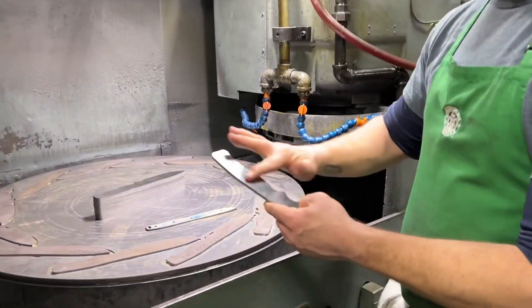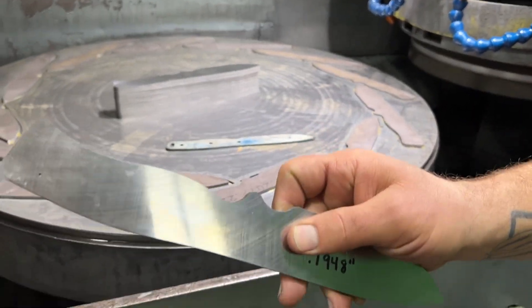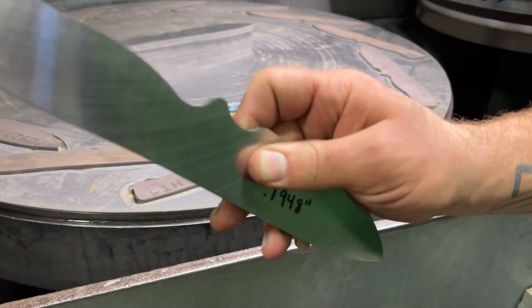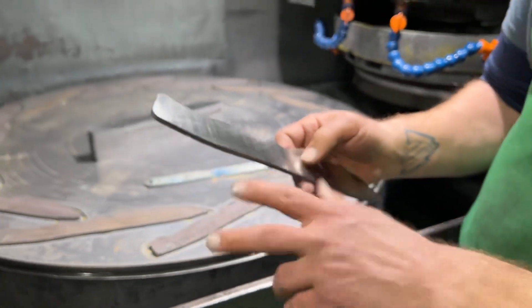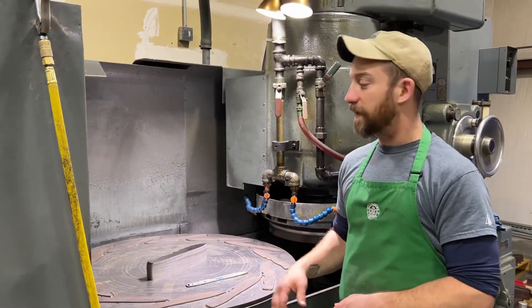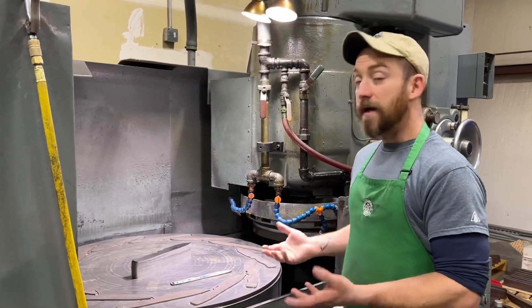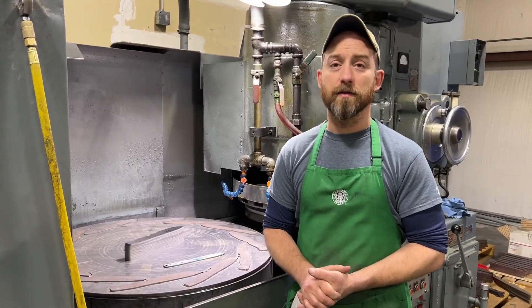This is just rough grinding, but we're able to use a fine enough wheel that you can still see a reflection of my finger in there. We have an even finer wheel that is optimized to take that last few thou after heat treat — that's going to be an immaculate surface. I hope you found this video helpful. I'm going to get back to work, but hope everyone's having a good weekend and we'll talk to you again soon.